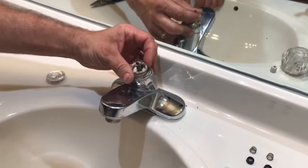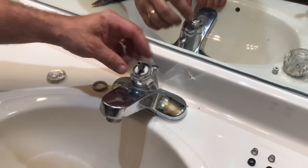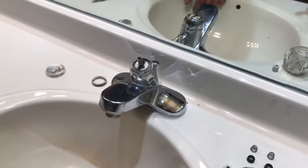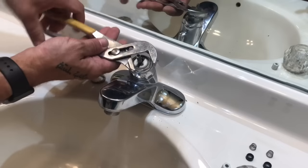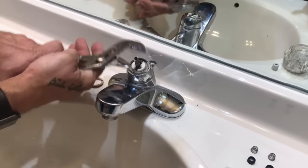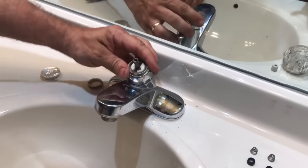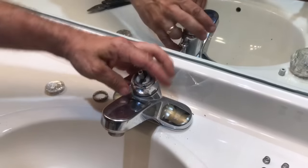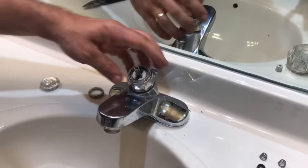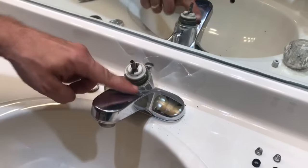As we take the rest of this off, all that does is put tension down on the controls inside to keep everything from leaking — but obviously that's gotten tired. Next we're going to take this retainer ring off. I'm going to use my channel locks; you want to get around the head of that thing. You can use a wrench that's this size — I don't know what size it is but it's really big, which is why I use channel locks. Sometimes if you can't get this off and need to shock it, you can tap with a hammer to break loose all the sediment that gets stuck down inside.